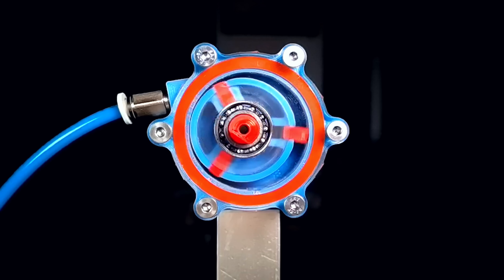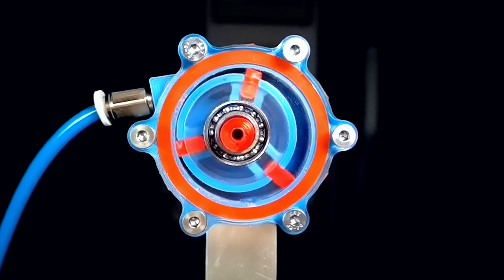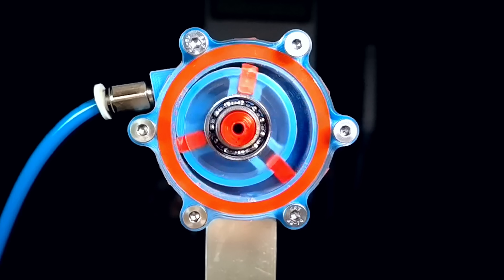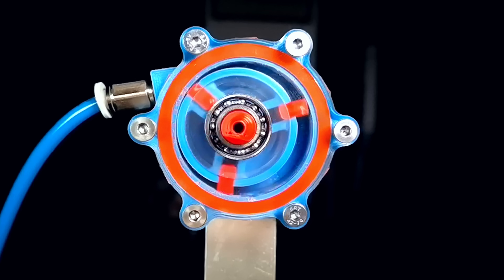The first thing I noticed was that the rotor is off-centered, because of this equation: Force equals pressure times area. If you center the rotor, the area and pressure are the same on both vanes and the forces cancel out. By off-centering the rotor, you ensure the area on one side is much smaller — basically zero — which means one force is always much bigger than the other. The vanes are free to slide and are pushed out by centrifugal force. The force applied to the vanes is always perpendicular to them, which means you always get 100% of the torque used for rotation. And there's no need for a valve.